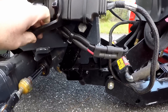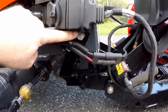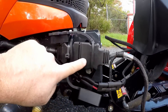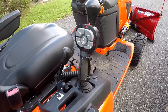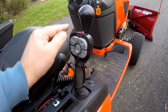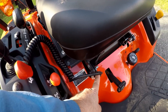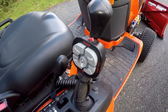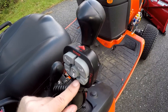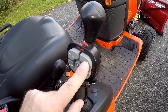On the right side of the tractor you can see how they ran the electric wiring, bolted the plow frame to the tractor frame, and wire-tied the heavy duty plug connector for the plow. An electronic hand control comes with the Boss V plow and has been wire-tied to the loader arm. The wire has been run across the tractor and down underneath the fender. Up on top of the hand control there's an on/off switch — with it on, all functions work; switched to off, pressing the buttons does nothing.